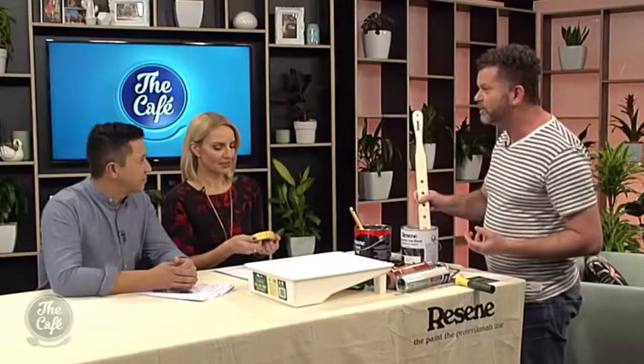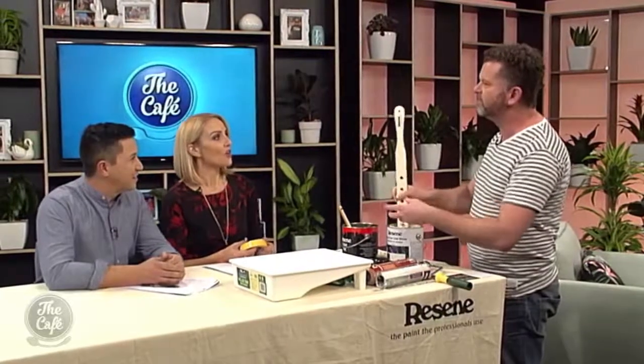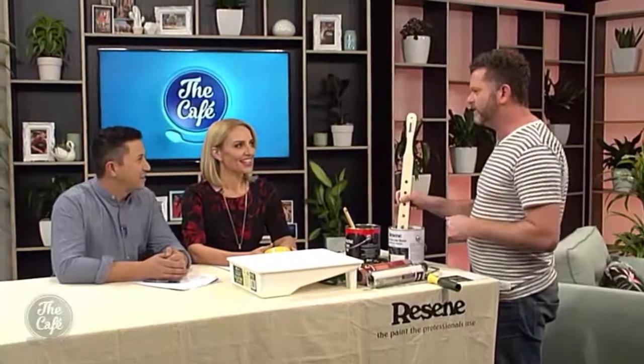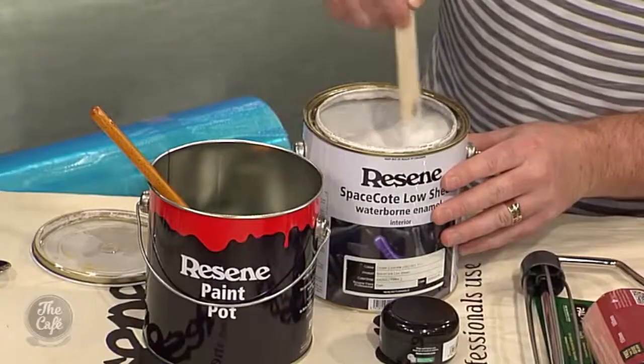It's not going to bond to the windows, because that's a major problem. You see people leave their masking tape around the window frames for three months and next thing you know it doesn't come off the windows properly, and when you paint up to it you're going to end up with a mess. Soon I'm going to show you what you should be doing without using masking tape — I'm going to have a go at cutting in and showing you a straight line.